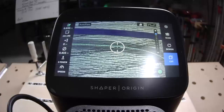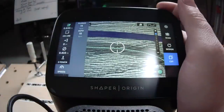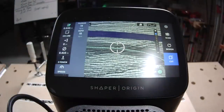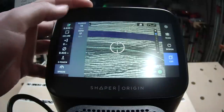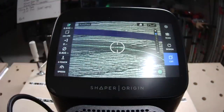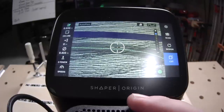Wants me to go that direction. Okay. I'm going to give you some space. You have your auto speed set to 15. You could even turn it up a little bit if you're comfortable. But 15 was good. It was moving. Okay. Let's do 17. Dare to be dangerous. And spindle speed, what were you using? I don't remember. I think I looked, and it was surprisingly low. It was at like 3. I'm going to keep it at 3, I think, because we'll keep that friction down. Good plan. Okay, here we go.